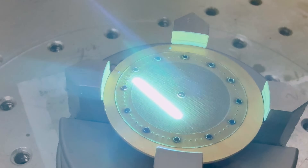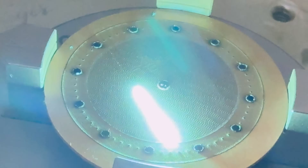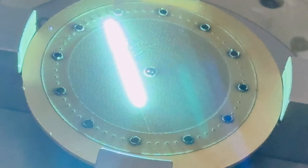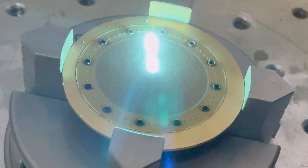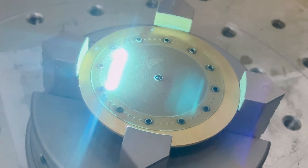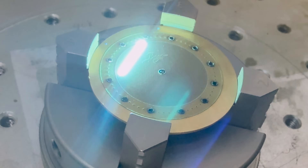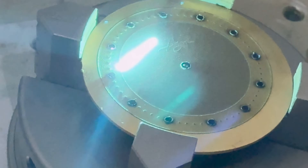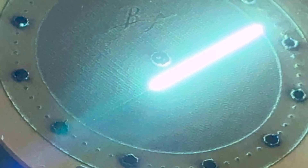Here it's going to start the 3D slicing and engraving — you can already see the Barger logo showing up because I put that in a brighter color towards the top. One thing I could have done to make this a much better engraving is set the line interval to 0.02 and the dot size to 0.03. That would have given it a nice overlap, a much smoother and higher resolution engraving at lower power. Of course that would have taken longer, but since I'm making this just for the tutorial and don't plan to use this dial, I'll use the faster setting.